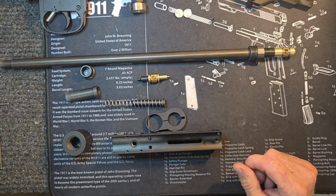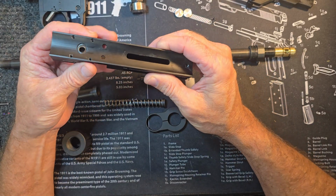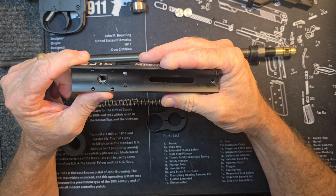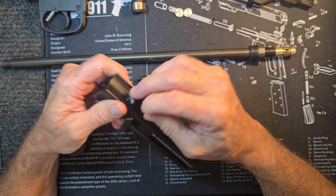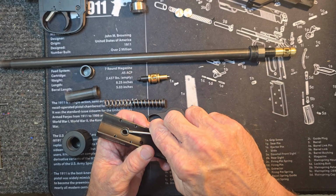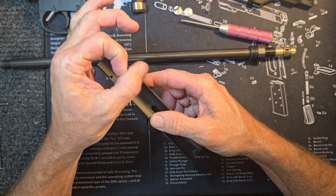So what I've done was this one here, this O-ring goes right there. Now, I had a 250 diameter hole in there, and I determined we could get away with 272 and still get the O-ring back out of there. Still leave a wall for that O-ring to be captured with.